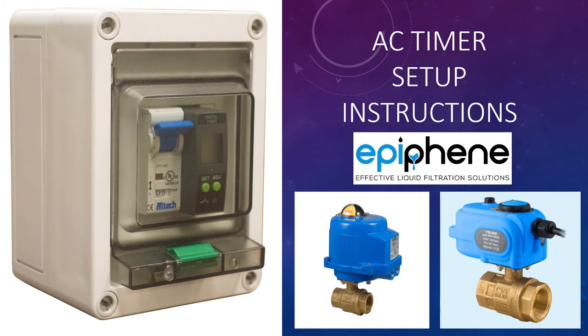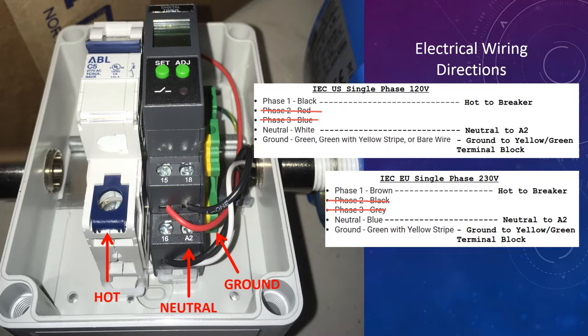It comes from the factory pre-programmed, but you may want to change that. When the valve is shipped with the timer, typically for a single unit application, the actual actuator will be already connected to the timer via a short length of conduit and pre-wired. And then there's another conduit here suitable with thread on the other side to connect your connections or cable with a liquid tight seal.